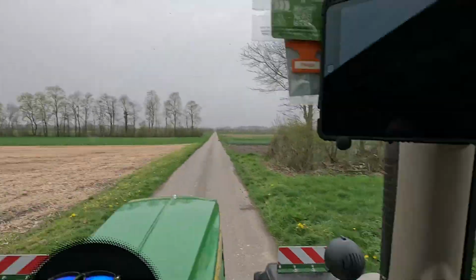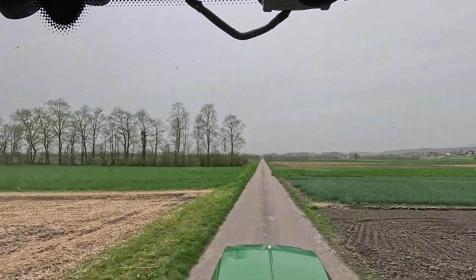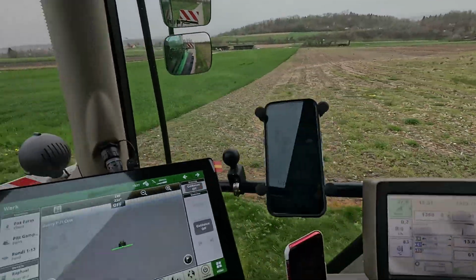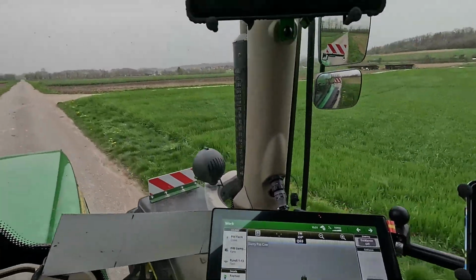And yeah, it could be or could not be that the tractor goes a bit faster. Officially, it doesn't go faster. Look, I'm not on even roads, I'm on very bumpy roads, but I'm impressed by those BKT tires, how smooth it is to drive. It's incredible, and I got quite a lot of pressure in it. I got 1.2 bars for VF tires. That's a lot, so it's smooth, and the tractor does go a bit faster.